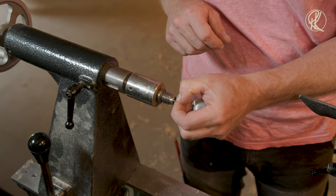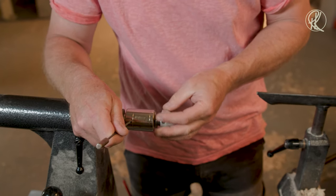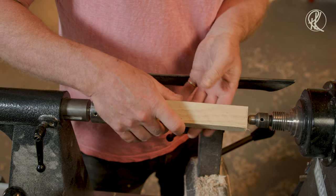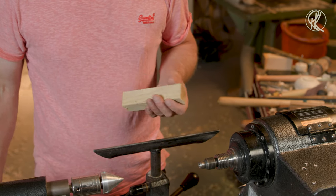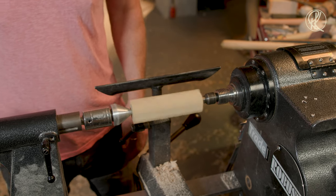Normally what I like to use as a live center is this type of center. There's a pressure ring here and it has a point. But to mount these blocks in the lathe I would like to have a cone — and now there's a cone. You'll see in a minute why, because this cone is going into the hole. On the other side I have a safe center, which is also nice because if you do this in production and you do a whole carton box in one morning, it's nice if you don't have to stop the lathe all the time. So you can start the lathe, put your piece of wood on the turning center, put your piece of wood on the other side, and there you can start.